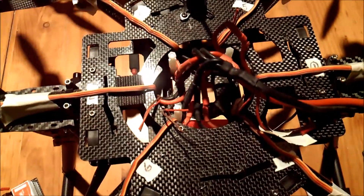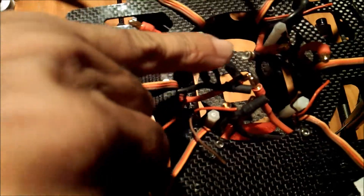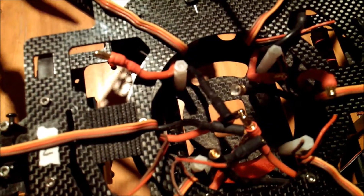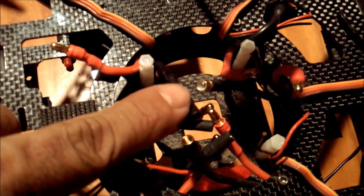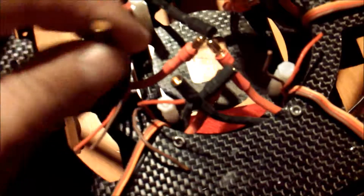Label everything as you go. I don't know if I can show you this, but this connector right there — that ground, black — let me see if I can magnify that. You see all that white stuff inside, right there? Now let me show you another one — look at this one. Look at that, nice gold color, no corrosion, no crap. And look at that one — all that white stuff. So there's a possible contact connection issue, and that's going into the ESC, so it's a good time to check what the hell was going on there. Maybe that was my problem — I was having poor performance.